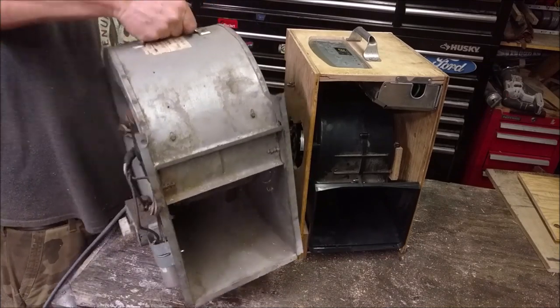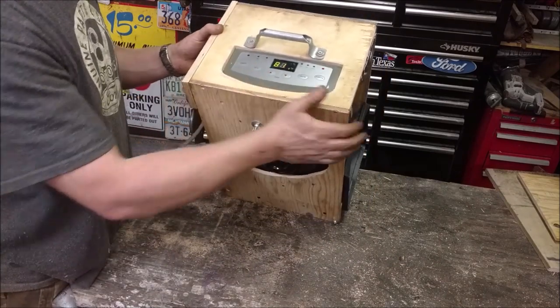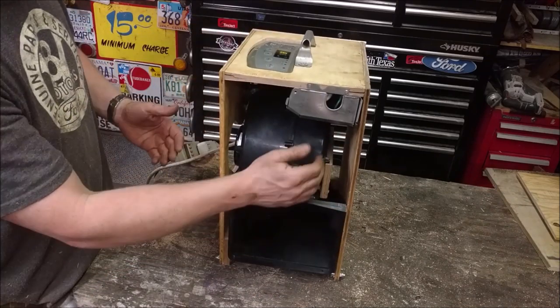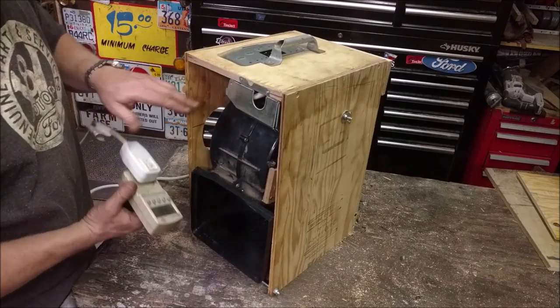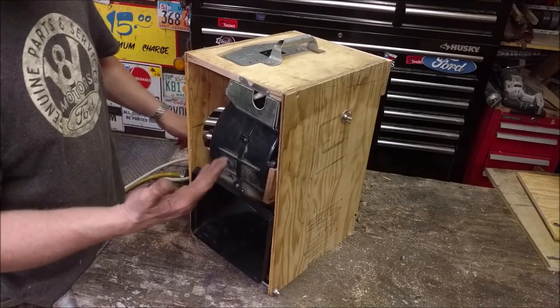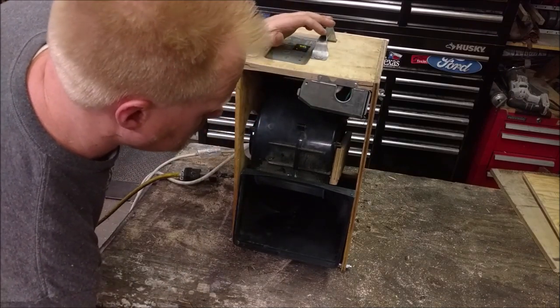The old one weighing in at about 25 pounds. The new one weighing in at about 15 pounds — super lightweight. It's 81 degrees right now. I put a block of wood across — this is the motor side, and it pulls in air on both sides of the squirrel cage. You don't want to block off the motor side because you want as much air to go across the motor to keep it cool. I ran it — this is a 2-amp motor — and I kept putting different blocks of wood across there until I got it down to right about 2 amps, actually down to like 1.9 amps. As a rule of thumb, just put something across — if you've got a hole that big, block about one third of it. That generally puts you right there, unless you're using it for dust extraction with filters in front of it, in which case you could eliminate this block of wood.